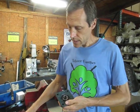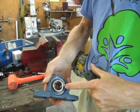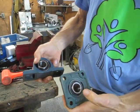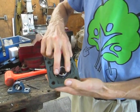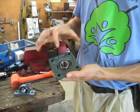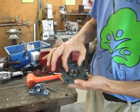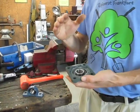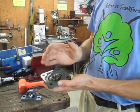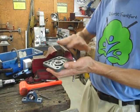The way these things are put together, you will find on one side or the other relief slots — here they are in this one, here they are on this one. The relief slots allow the bearing to be turned sideways within the housing. The outside surface of the outer steel race is slightly spherical — shaped slightly like a ball — and it matches a spherical machining on the inside of the cast iron so it can be rotated into place within the housing.